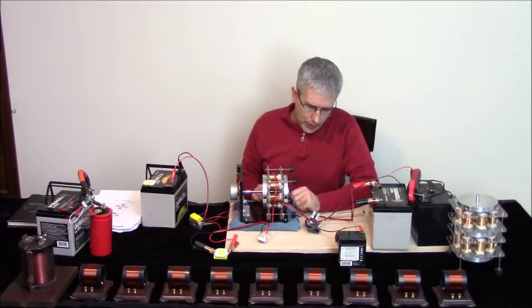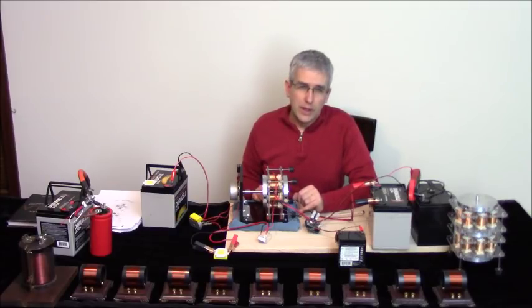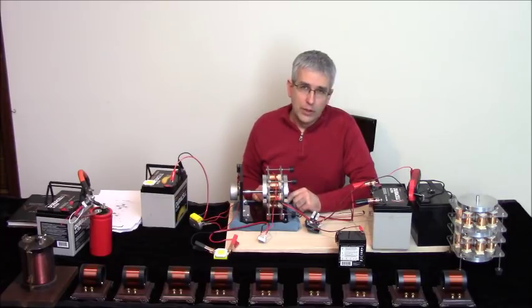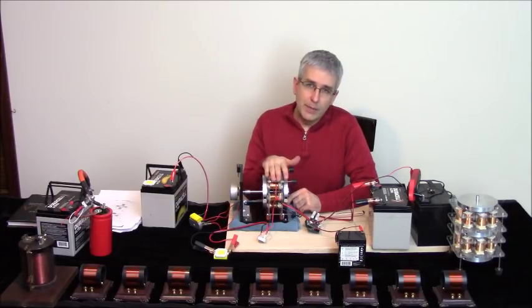so the Arduino board, we've got two MOSFETs on here. They're 100 volt MOSFETs, and the gate driver works really well with them, and we've got a fast switching diode here, and we have various different code. We have code that can keep a desired RPM. It regulates the motor to keep the RPM. We have code that is whatever frequency you want during the on time.